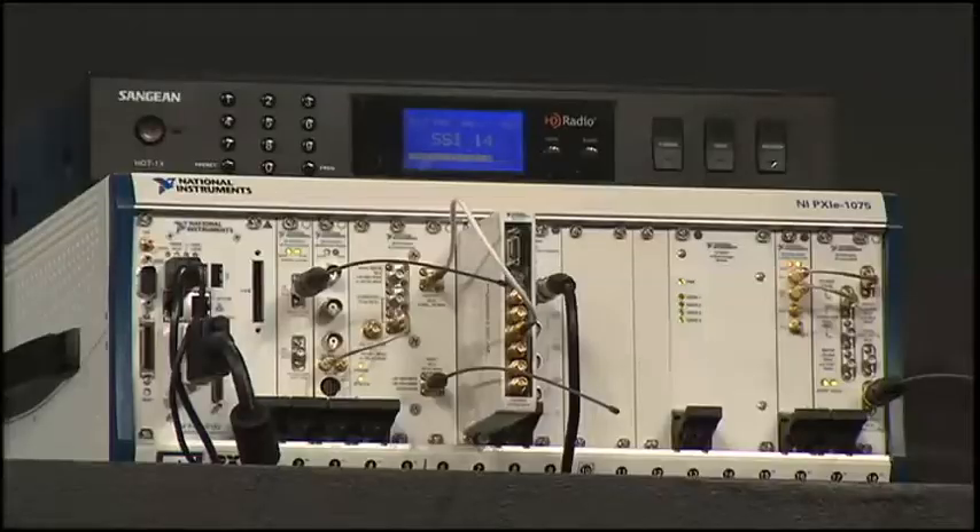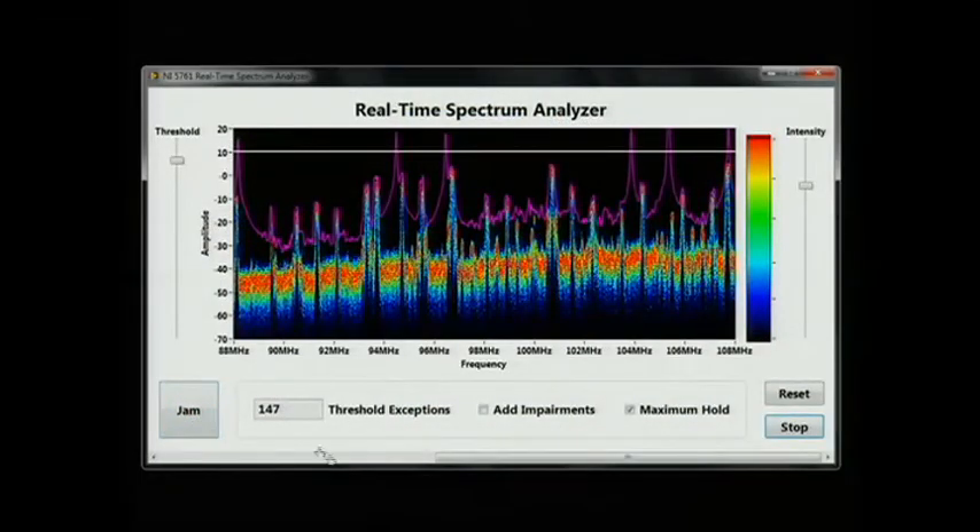You're not only acquiring the entire FM spectrum, but you're also generating it. If we connect our FM radio to the new PXI Express 5451 arbitrary waveform generator, we can tune right in. And if I check this box to add noise and enable multipath fading on the FPGA, you can hear the effect on the audio.